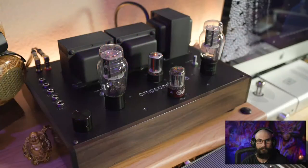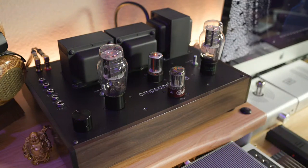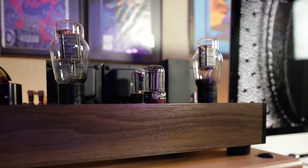And almost always, guys just go to eBay and buy a tube. They'll tell you it's new old stock. Let's say a 5AR4 rectifier. It's new old stock, the minimum is 32, and this one measures 50. You're like, okay, great, it's 50. They didn't tell you that the brand new number is actually 150, and that new is 100. Anything above 100 you consider sort of new. So you bought a tube at 50 because he told you that it's 20% above the minimum number